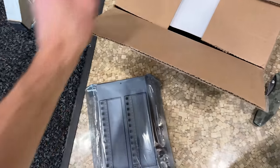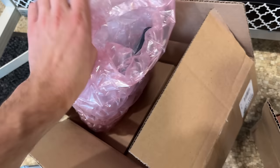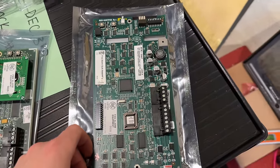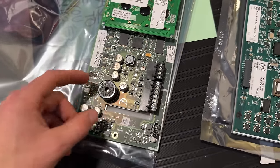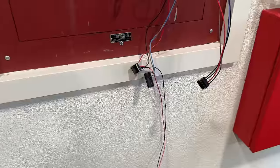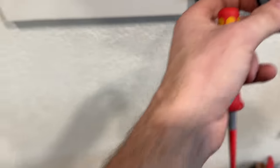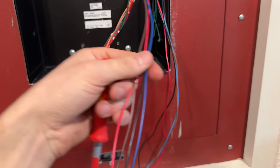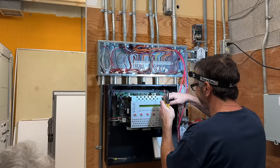There's our ACM, and this should be our LCD — yes it is. I'm going to hook these up here. Our ACM needs 24-volt plus, ACS positive and negative, and then this guy needs its 24 volt and then four wires: communication, transmit, receive. Power for the one, jump it over, ACS for the ACM, and then transmit and receive for the LCD 280, which is coming off its own 8-conductor, and then communication for ACS and then power 24-volt.